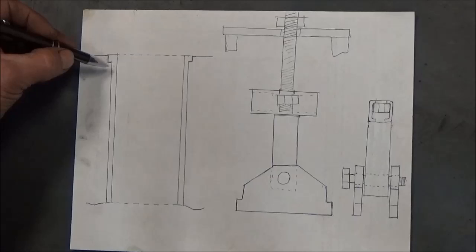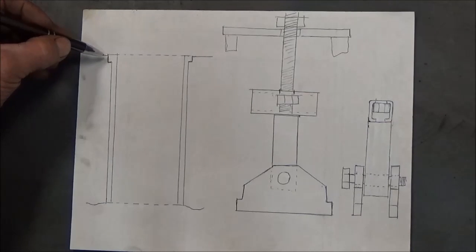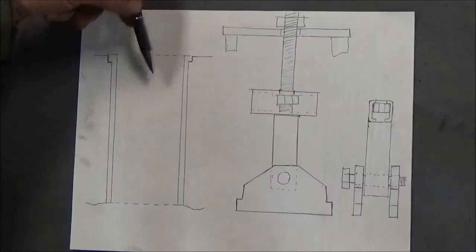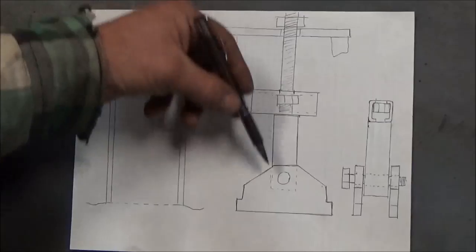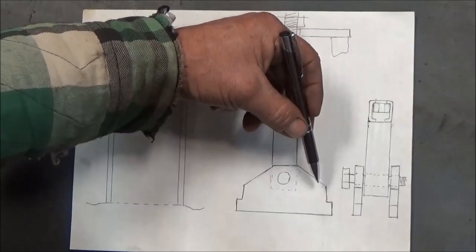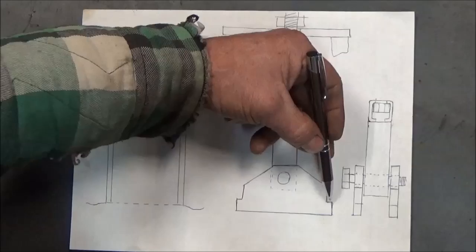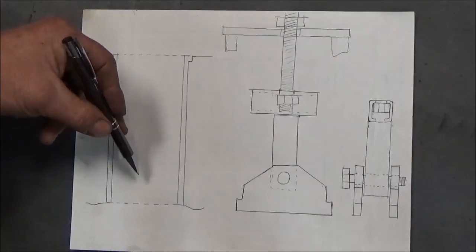This offset right here in the drawing represents the outside of the cylinder. This goes into an offset cutout in the top of the cylinder block. This is the cylinder, the part where the piston rides up and down. I'm going to cut out some pieces and I've already got that drawn out on the metal that's going to be cut out. This little area here, this little corner here and this one here — this goes inside here.